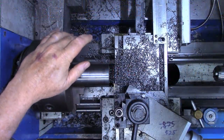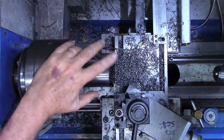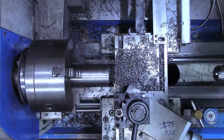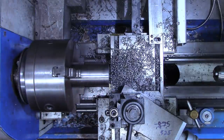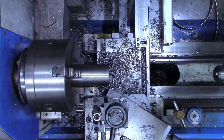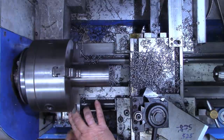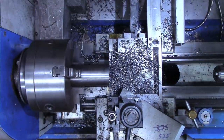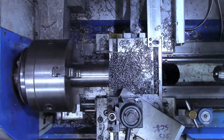I've got you positioned now up over the lathe. I've got a piece of two-inch stock, which is the closest to the size we need. The outside dimension of our piece is an inch and a half, so I need to turn down this stock — just some common turning down to an inch and a half. I'm going to zero out the Z-axis DRO and turn about an inch and a half of this piece down, so I'll have plenty of room to get the knurling tool and the parting tool on. The carriage stop is locked in place. This is just turning raw stock down to a size we can use to make our part.